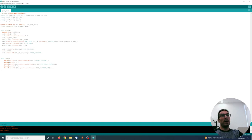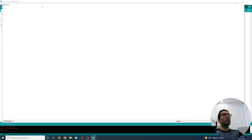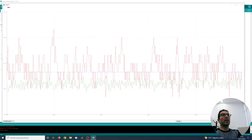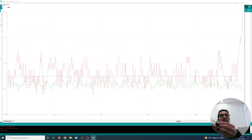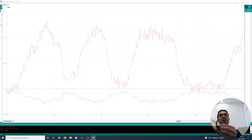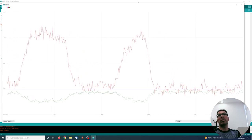In this first example I'm setting the PWM goal so the motor will be controlled through the voltage. I'm monitoring the actual PWM value — which will be a fixed value — and also the current and velocity. Once uploaded and the Arduino plotter is activated, you can see that the servo has a peak current at the beginning (this is the start torque) and then it starts spinning with a more or less constant velocity. The blue line is the PWM signal.